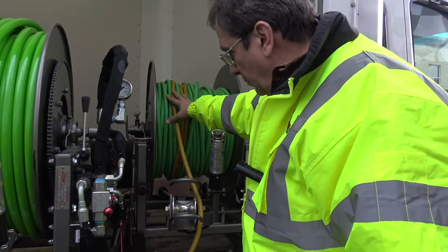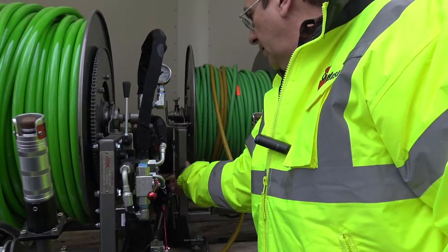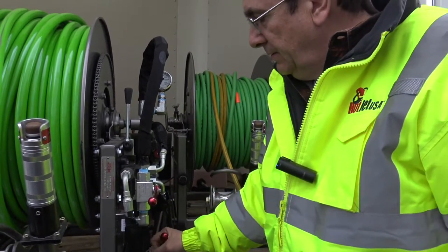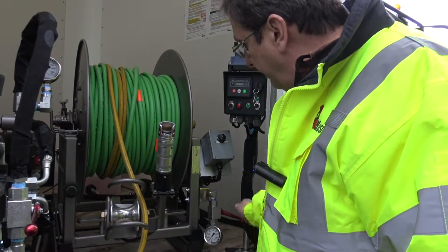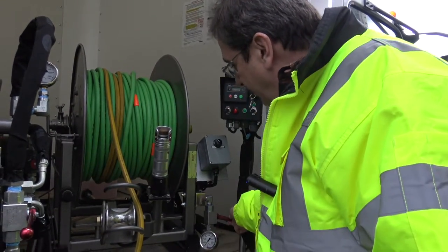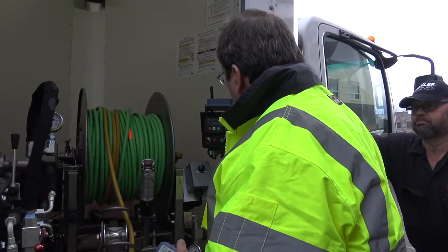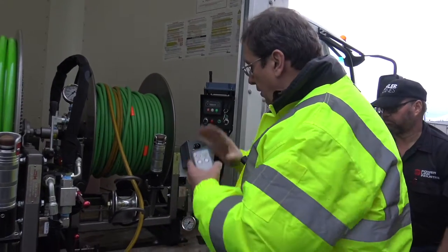Again, this hose is marked and it's got the leader hose on it. Throttle's right here — when you start this unit, we want you to throttle in and have this in the open position. That's your start position right there. Make sure your other hose reels are in the off position. This unit has remote control — real simple, because this is our cold water diesel unit. We're going to get the sticker up here, but when this ships we'll have all the controls covered.